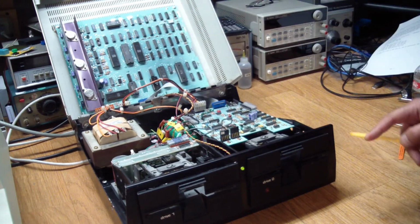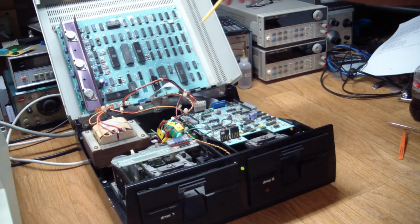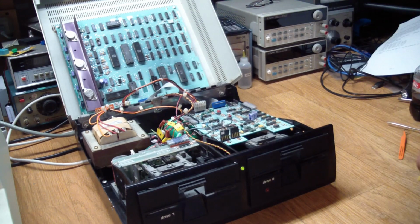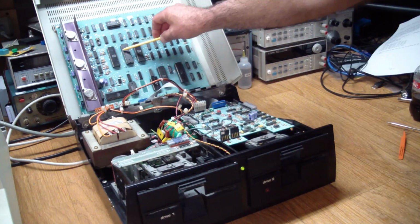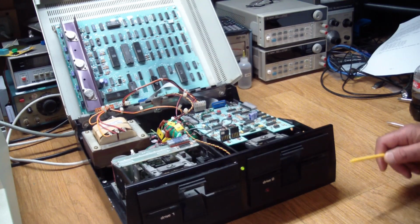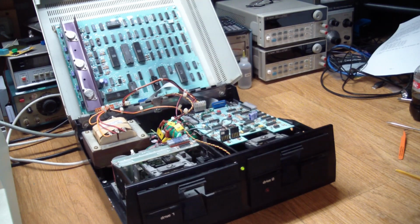It's still a PIA, and these PIAs have RAM inside them, and you can route interrupts, generate interrupts, and stuff like that. But the 6530 additionally has a small masked ROM in it. And the reason I say it's the Achilles heel is because if that ROM goes bad, 6530s aren't made anymore. If you can find one, they're not user programmable.